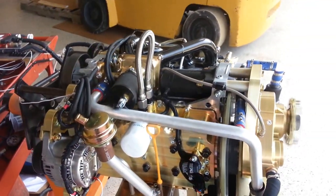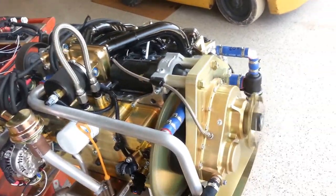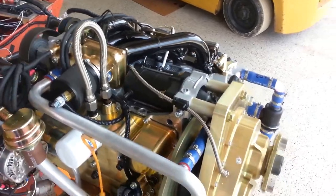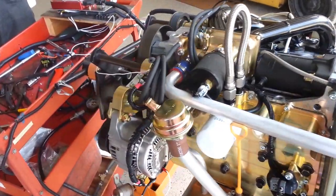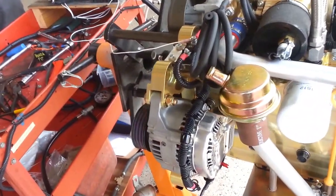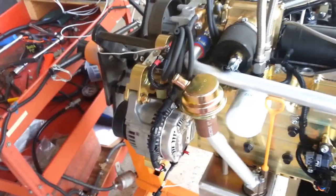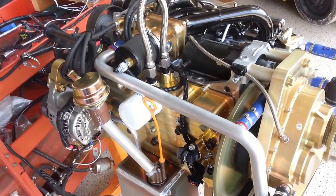When you do your check to see if it runs on the backup computer, it will shut down if you just do it with the engine at idle and no propeller, because there's no inertia to carry it through. First, you check the alternator — you can kind of hear the RPM drop when I turn the alternator on.